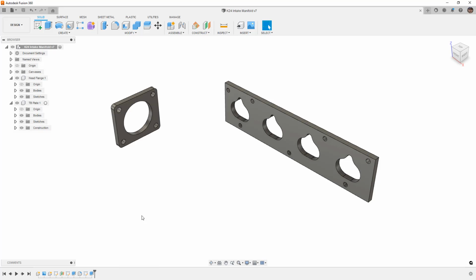And if you're going to carry on with the next video, then what I want you to think about is off-the-shelf components. You need to be able to find oval tubing that matches your size. You need to be able to find a plenum tube, whether it's 3-inch or 4-inch diameter. Find a piece that you can actually use, because there's no point in designing something DIY that you can't actually buy the parts for. Or you might find that a 3-inch diameter aluminum tube might be really cheap because tons of people use it on intakes, intakes for intercoolers, or maybe it's used on exhaust tips, or maybe it's used for this or that. But 3 1/4 might be extremely expensive. So these are things that we need to think about. And if you're shooting for a specific volume, that's where you could say, well, this pipe is really expensive, so I want to make this plenum a little bit longer to get the volume I need. But we'll talk about that in the next video.